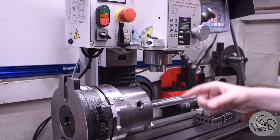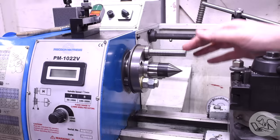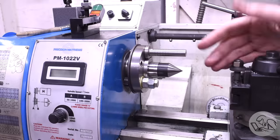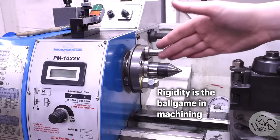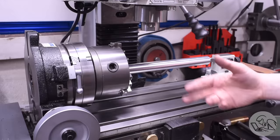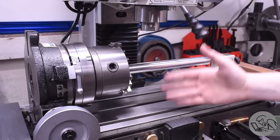That intuitive leap is really useful because the reason you want to start with the lathe is that lathes are much more rigid for their size. And if you're a hobbyist, size is almost certainly a concern - most of us don't have as much space as we would like. The lathe lets you get a lot more done in the same amount of space. The geometry of them is such that they are extremely rigid by nature. So if you can get past the intuitive leap that the work is spinning and the cutter is stationary, you unlock a whole world of things you wouldn't be able to do with a mill in the same space. Obviously the mill is much more convenient for certain operations like creating large flat surfaces, so we all tend to end up with a mill and a lathe sooner or later. But if you only have room for one, definitely make it the lathe.